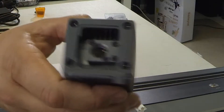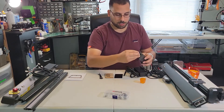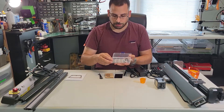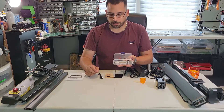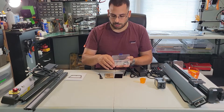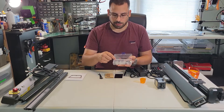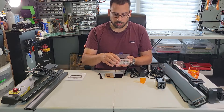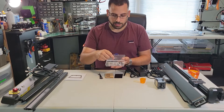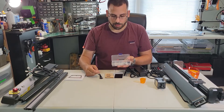There's the bottom of the laser where you can see the lens and where you screw in your air assist nozzle. You have a box of screws: four M4 screws to attach the frame together, two M3 screws for your limit stop on the Y axis, two set screws for tensioning the belts, and two idler assemblies for the Y belts. Also included is an SD card reader with an SD card, a set of keys, and the tools you need to put everything together.